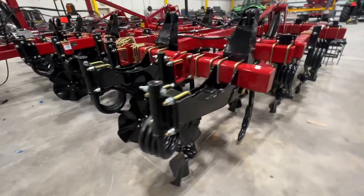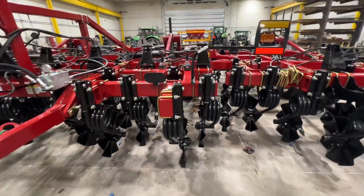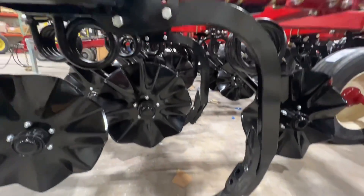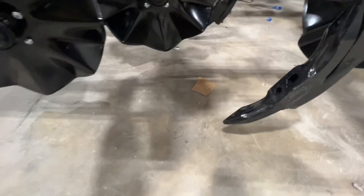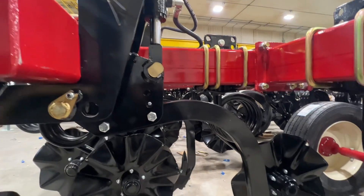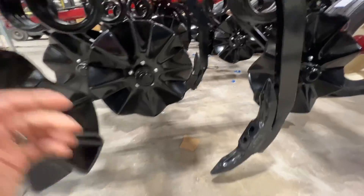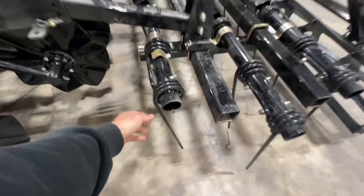It makes this an extremely versatile tool. We go from managing corn stalks to managing headlands, because you're typically not going to chisel every inch of your field. You can do it on the fly and hit those areas where water lays or high traffic areas. As for depth, the cylinders aren't all the way down right now, but they're usually going to sit about four inches below the blade depth — so seven to eight inches is not out of the question with those shanks.